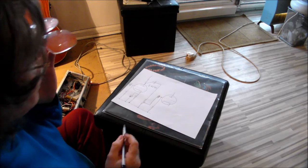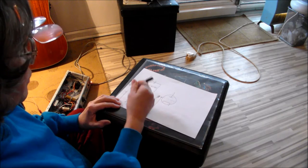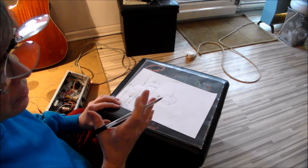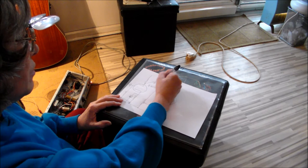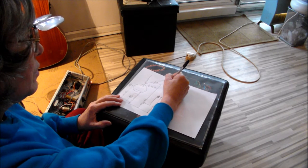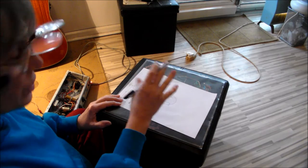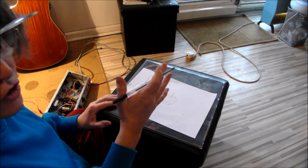Now I've disconnected this capacitor, and it didn't make any difference, so I soldered it back. The obvious thing is that capacitors are a constant problem in electronic devices, and in this particular instance it happens to be a 0.01 µF ceramic, and it's gone short circuit. Well, not totally short circuit, but it's got leakage problems.